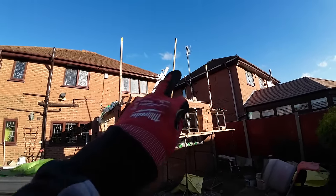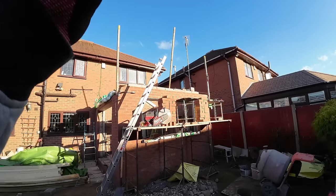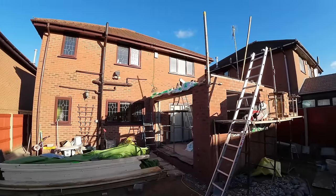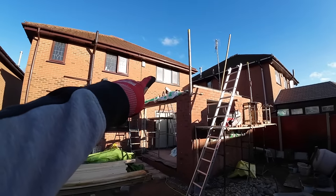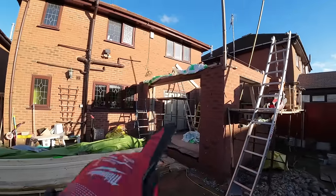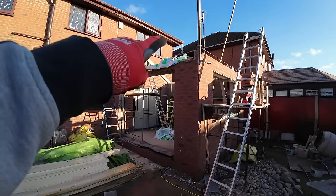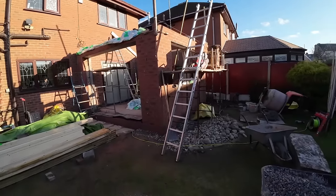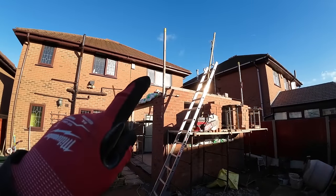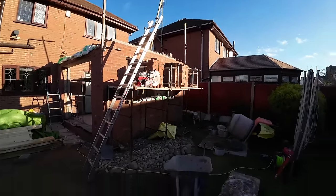We've got the big roof batten there, that's having this screw put in at 3 meters 440, which is the top of the spar on top of the ridge on the house there. So we're just transferring that point across to here. We're going to measure up off the wall plate at that end for the upright of the spar, and then we're going to put a line down. Set it up here, up to the nail, back down to there, and that'll give us our pattern to follow.